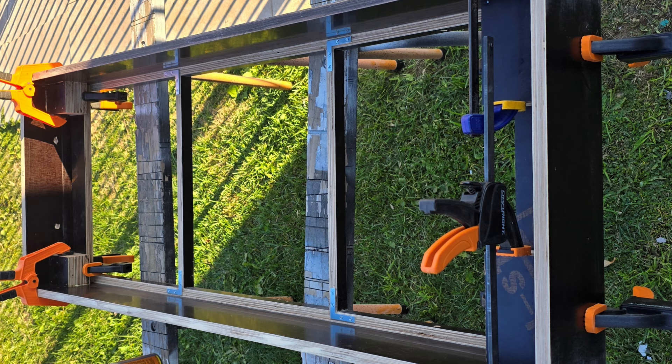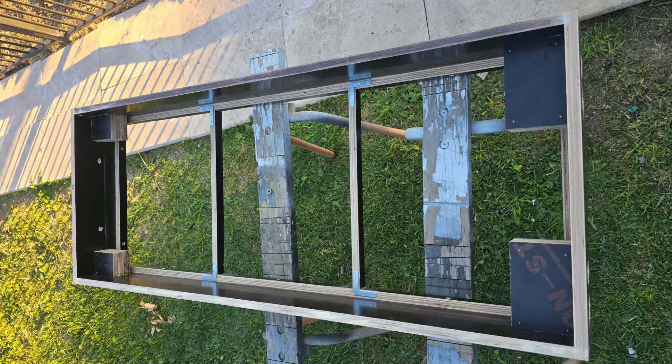At the ends here you can see I started to put in the leg blocks. I'm going to have some folding legs so I needed space to put in the folding hinge hardware. I started to glue it in place. That piece of wood you can see is just a spacer to make sure these blocks were in the right position or height so that once the legs folded with the folding hardware it was flush along the bottom of the framework. I've also screwed those blocks in from the sides and from the front, and filled it in with wood putty for a smooth finish. The blocks are different widths on each end due to how the folding legs fold in when you fold them down.